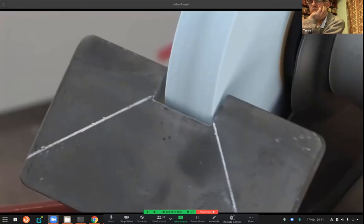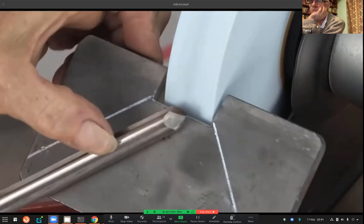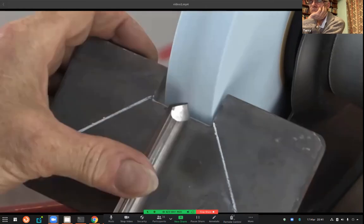A bowl gouge has a different flute configuration than a spindle roughing gouge. This is why the bowl gouge does not need the flute rolled all the way over to the closed position for the inside surface of the flute to remain parallel to the platform.